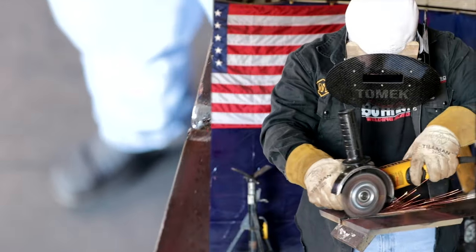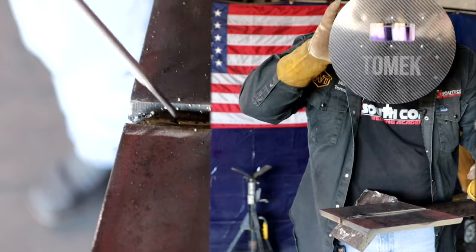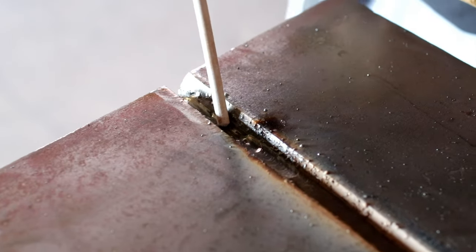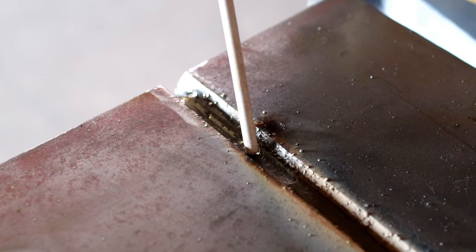Alright guys, so I went ahead and cleaned the slag off of my weld right here so I can perform a tie-in, so I can show you how I tie in. So what I'm going to do, I'm going to start about a half inch in front of the leading edge of that weld I just did, and I'm going to follow the edge of it